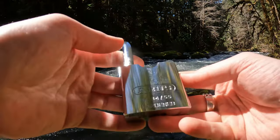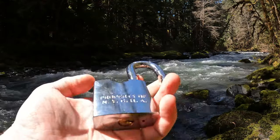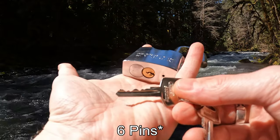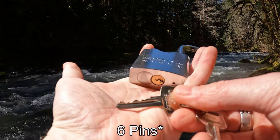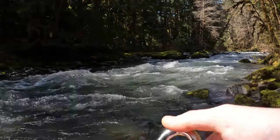It is guttable. So when I get home I will gut this for you. If I'm going to read the video now, here's the bitting on it. So you have five pins, full security pins, at least three spools in there. We'll see when we get home.